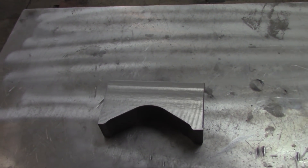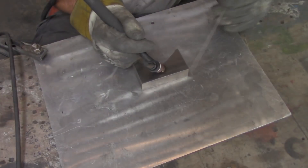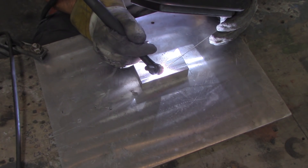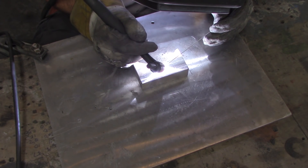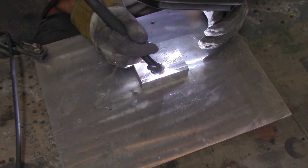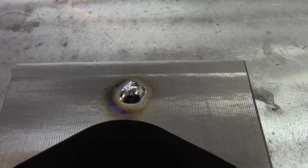To start this off, all you really need to do is grab yourself some sort of block of scrap metal or whatever you want to work with. In this case it is a block of CP1 Titanium, about an inch and a quarter thick, just laying around in my scrap pile. And you need to start yourself a nice little foundation, which is just nothing more than a few dabs to kind of stack it up and make essentially a blob. It is just a solid blob of metal — that is your foundation.